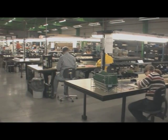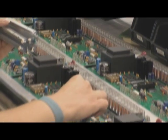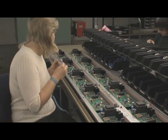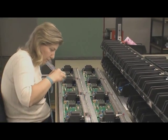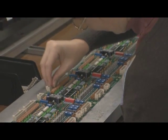The larger components are placed through holes by hand. Each order is divided into a succession of specific, simple assignments that can perfectly be executed by our employees. When placing the components, it's important that we do not electrostatically charge them. That's why our employees work on an electrostatically protected floor. Their special arm or foot band does the rest.